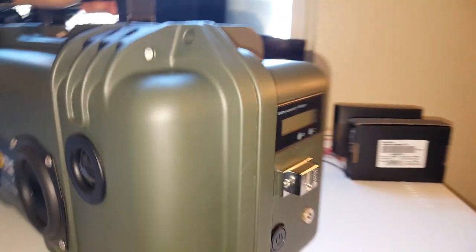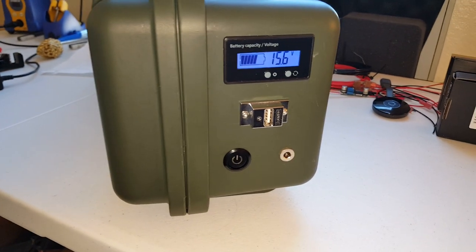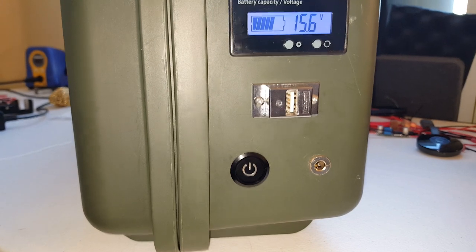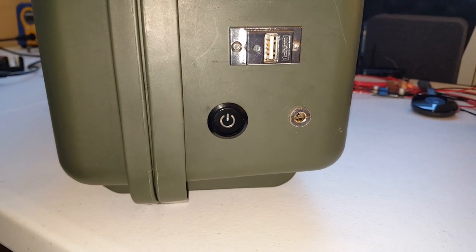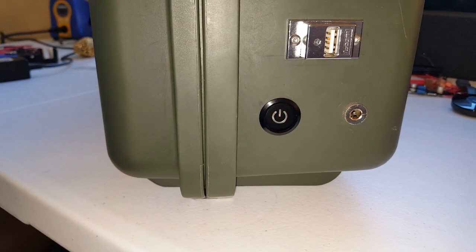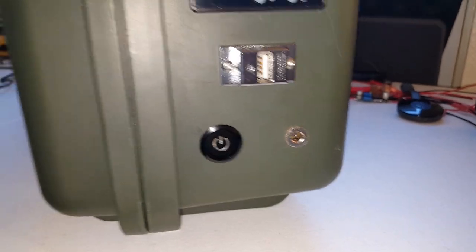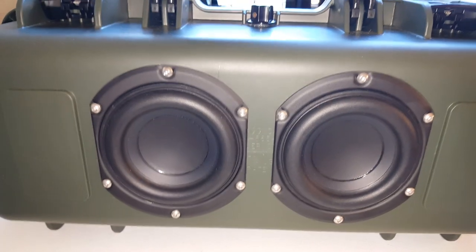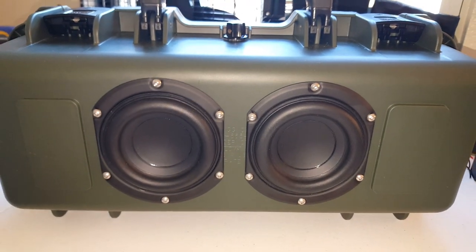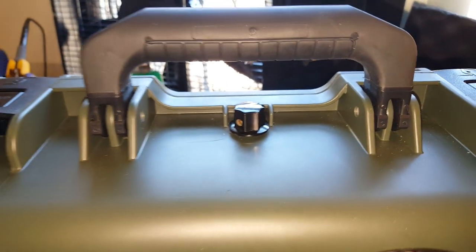On the side I have a little control panel. I bought a battery capacity voltage gauge from Amazon, an Elcom USB passthrough, and a single pole double throw battery switch configured to charge only in the off position. There's also a 2.1mm jack for charging. In the back I have two Peerless Audio 3.5-inch passive radiators, and on the top is the volume knob attached to a B100K potentiometer.